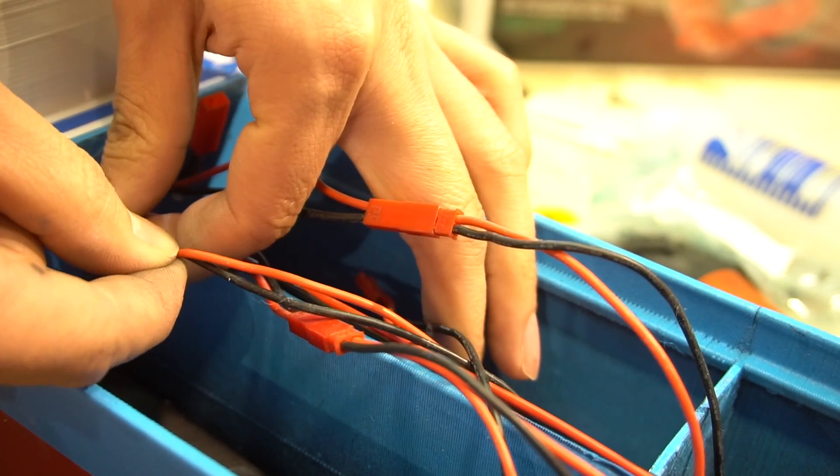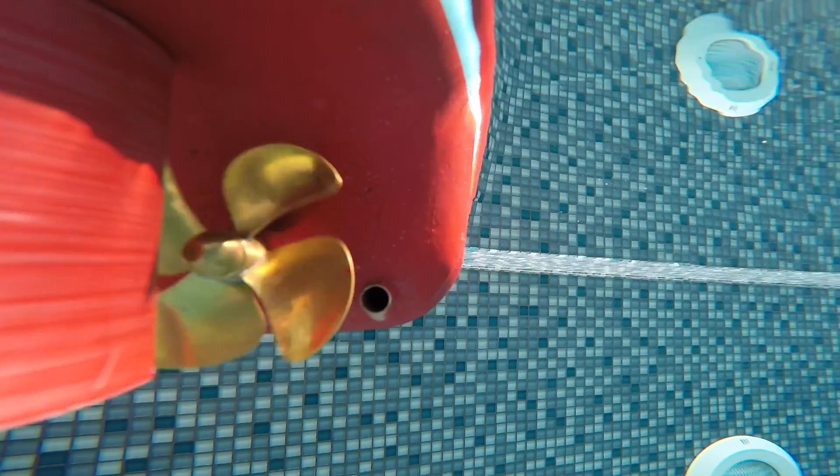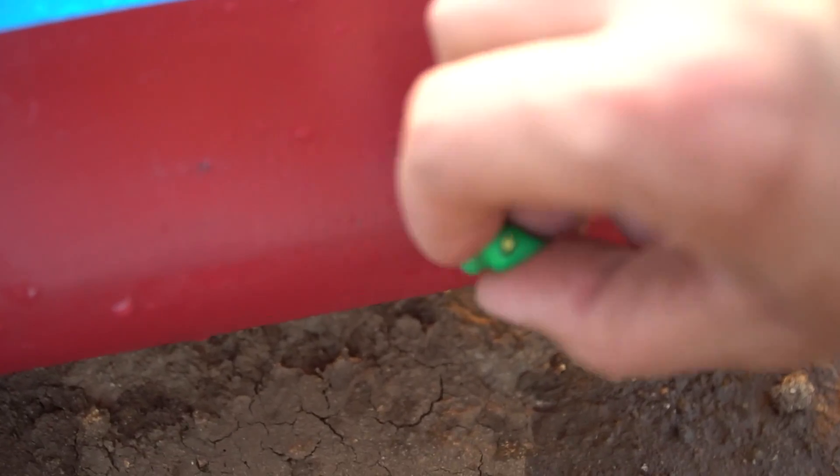What did you guys think I was going to do, make you 55 minutes of boat b-roll? Let's talk about the project. Initially when I designed the boat it was really designed to run in parallel - that's why there are holes in the back and through the sides of the hulls. The idea was to ingest fresh seawater and keep the reaction going. Because if you let it sit in a closed cell, magnesium hydroxide forms on the anode surface and prevents the process from happening.